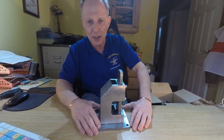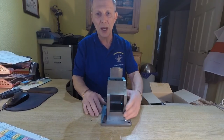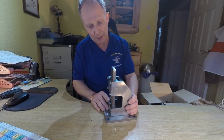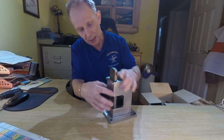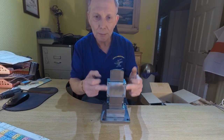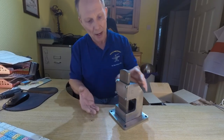This was the second one that I did a couple of weeks ago, and it's all slotted - it's like a jigsaw puzzle. Slots together, makes it much easier to put together. The only trouble with this one was I made my tolerances way too tight and I had to do a lot of filing. This is why it's all shiny - once I'd filed all the little lugs and slots I decided to just run the linisher over it. This was still quite tricky to set up; you needed to get it clamped right just so to drill for these holes.